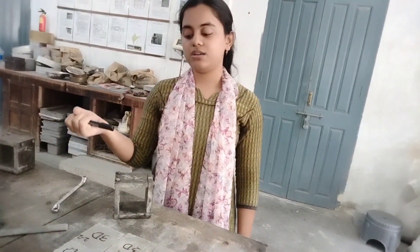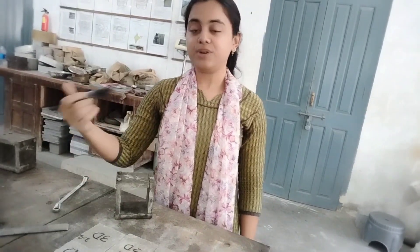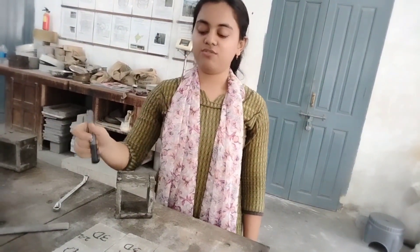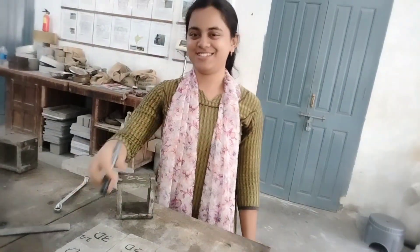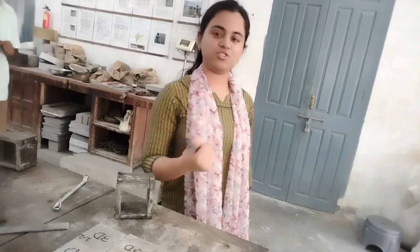This cube dimension is seven centimeters. The cement mortar cubes are a mix of cement, GGBS, Geolite, and Alcofine. We added these admixtures in percentage by weight and used Zone 1, Zone 2, and Zone 3 sands. The remaining details will be conveyed by Joshna.